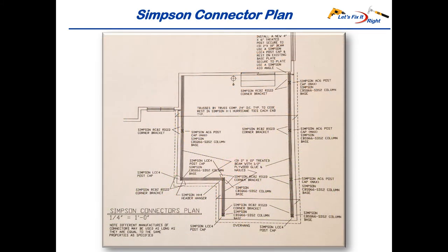Prior to starting this project, I never heard of Simpson connectors. I mentioned that I worked on a framed carpentry crew during one of my summer breaks from school. At that time, we did not use them, and I don't think Simpson connectors existed or were well known. If I designed this patio by myself, without my brother's expertise, I would have erroneously failed to include these valuable connectors. Consequently, the strength and integrity of the structure would have been significantly degraded, and I most likely would have done a lot of rework and encountered some problems with my building permit. If you are serious about building a similar structure, I strongly recommend that you review the SimpsonStrongTie.com website. It provides numerous building connector improvements that significantly improve the strength of structures.